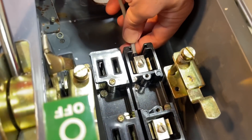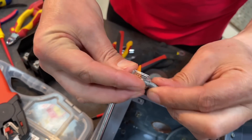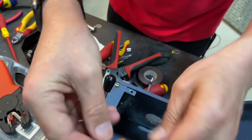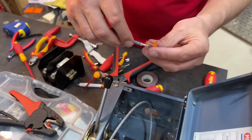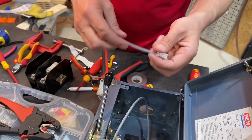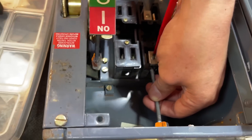So this is touch proof even though it's got an interlock — I wonder why that is. There are big terminals here, so I'm not going to be able to get thin wires in there. I need to bring out some quite thick wires, even though this is not going to be used as a switch — it's just a signaling device for a little module that we'll see soon. So using a Wago converter to go from this big chunky wire down to a small wire.